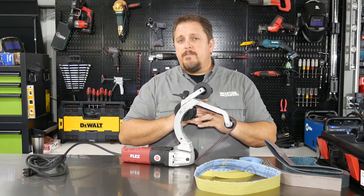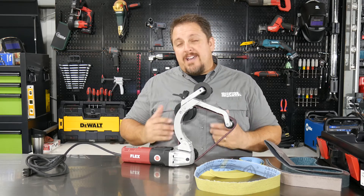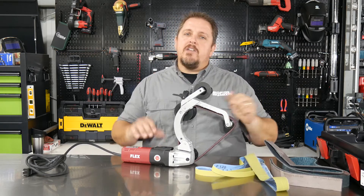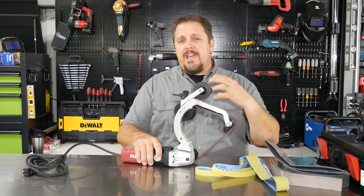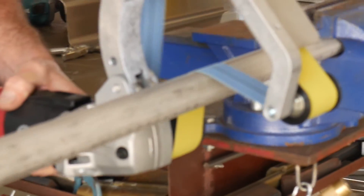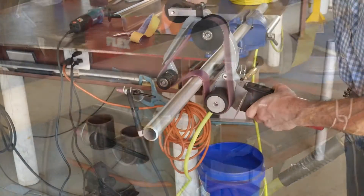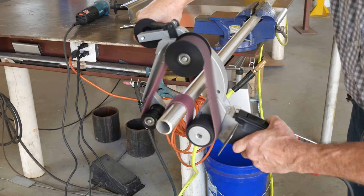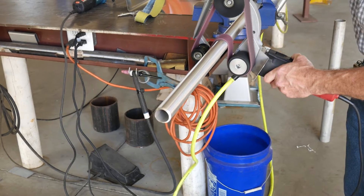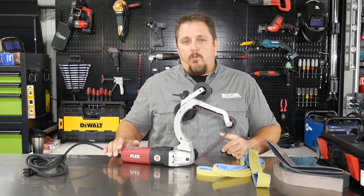So when you're doing fabrication work — maybe you're welding a joint and you need to grind that weld out — you're not breaking out your grinder because it's going to leave some pretty ugly marks. So you reach for something like this, you put on your 80 grit and work in that first pass. As you see here, when we gave this to AIS, or Advanced Industrial Services — they do a ton of handrail — they were able to show us how easily the Flex could put a polish on that pipe. They made the first pass with an 80 grit, then came back with a finer grit to put that number four polish on it. Still had a brush finish where you could still grab hold of it — it wasn't slick — but it did a really nice job of polishing that pipe with just a couple of minutes of work.